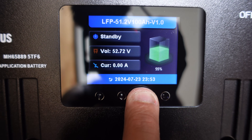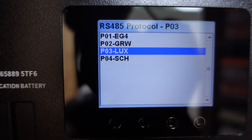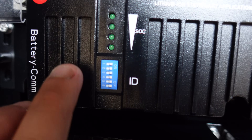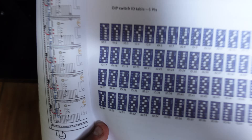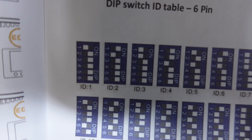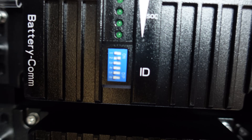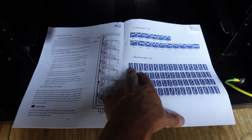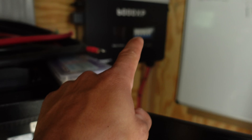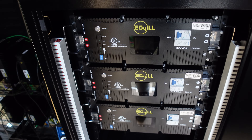After the power cycle, hold the button for five seconds again to confirm the settings saved — and you can see it is saved on P03-LUX. Now configure the DIP switches: ID one has the top switch to the right, all others to the left. ID two has the second switch down to the right, everything else to the left. ID three has the top two switches to the right, everything else to the left. I've heard the first ID is only for the correct inverter, and since these are the EG4 brand, we should be good.